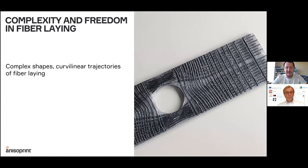This gives us several key benefits. First, there is great flexibility in fiber placement capabilities — what types of curvilinear complex fiber trajectories you can design or print to locally optimize the structure and material properties at every point through so-called fiber steering. By making curvilinear trajectories, this gives huge optimization capabilities so that material strength is focused in every material point.